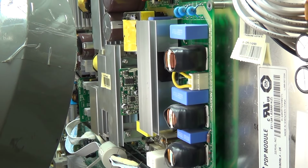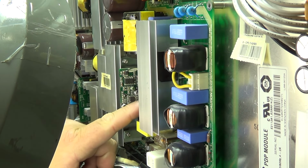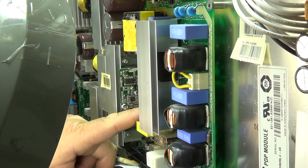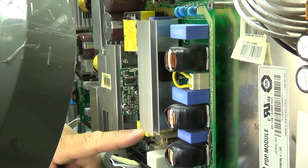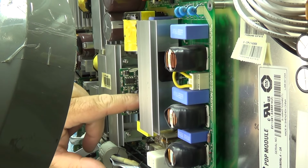I'm measuring like 40 ohms across this thing. I've got it in the circuit, and I'm able to get my probes on it. I'm not convinced that this is good. Well, this is in the regulation circuit. It looks to be on the oscillator. I'm on the primary side of the switching power supply, the switching transformer is here, and this is on the primary side. There's a little capacitor here.